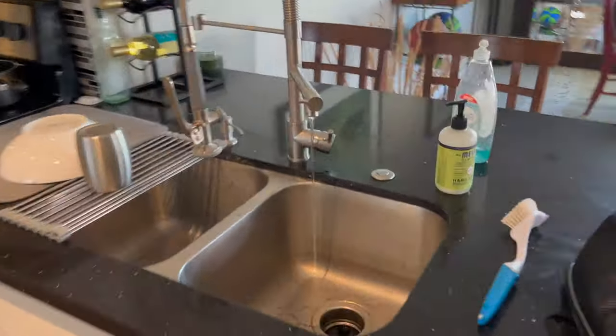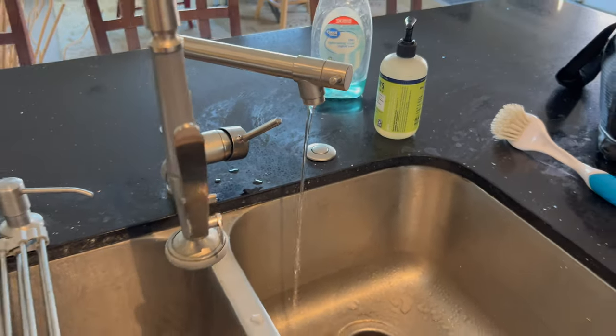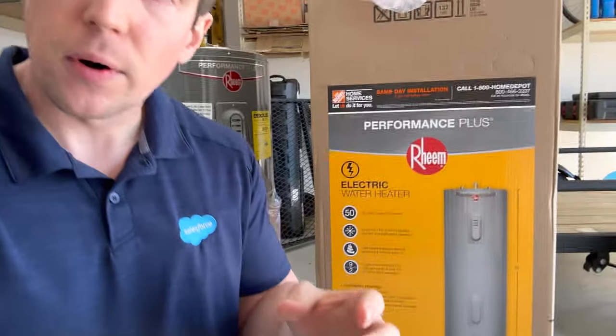Checking back inside, the water is working — that'll help it drain a lot faster. One quick tip I would recommend: take a tape measure to Home Depot or Lowe's or wherever you're getting your water heater and check the dimensions, because it's a huge hassle if you buy the wrong size. It'll actually tell you on the box how tall and how wide the water heater is. Mine should be an identical replacement in terms of height, but if you have a variance in height you might have to do some work chopping some copper pipes or PVC tubes. They do sell flexible fittings so you can make those connections more easily, but try to get a water heater as close as possible to the exact model you already have.